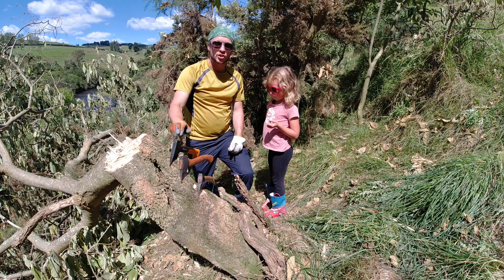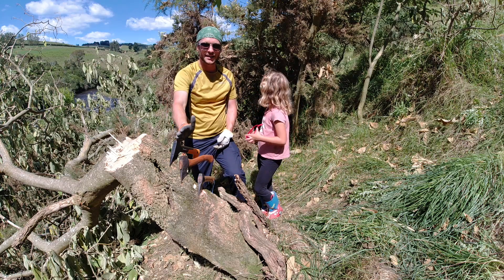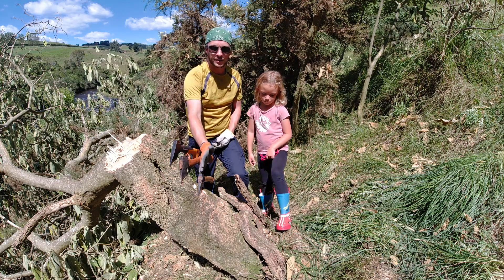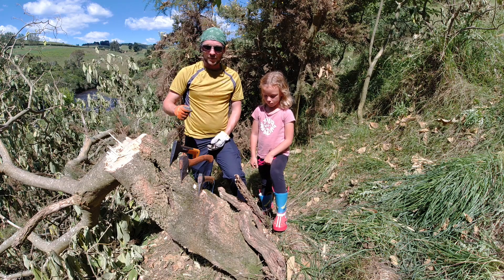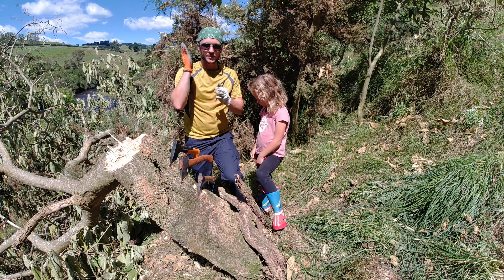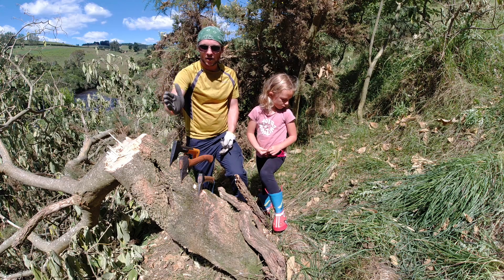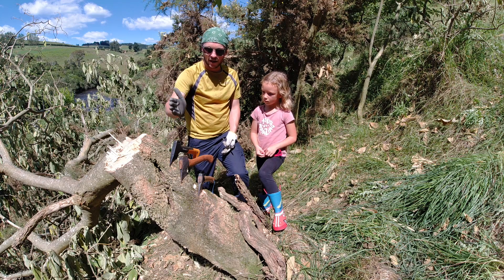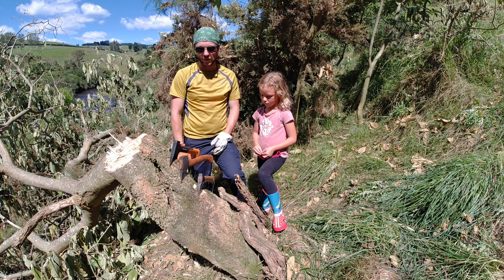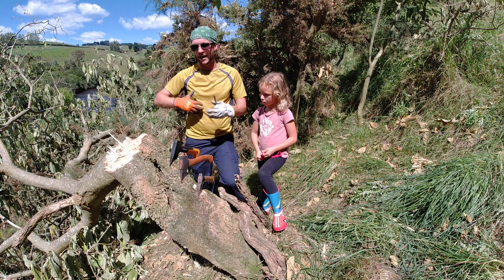On a final note, all of these have been sharpened the same way. I didn't do a microscopically fine edge because I wanted today's test to be reflective of results that anybody could get at home. I sharpened them all on diamond plates up to about 600 grit, then smoothed the edges on a Spyderco ultrafine ceramic, then took a Spyderco fine ceramic rod and did a little micro bevel to take the burr off, then stropped them on leather — first on chromium oxide, then diamond, then unloaded leather. So they're all shaving and push cutting through phone book paper.